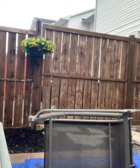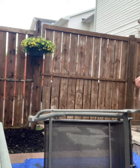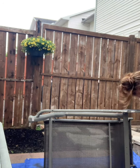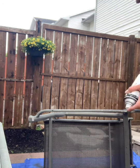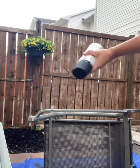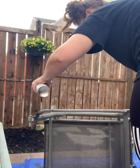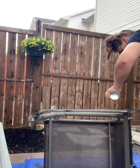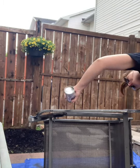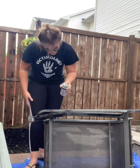Then it was time to spray paint. With the black spray paint, I worked my way around the chairs. I opted to start them on their sides — I'd do one side, let it dry, then flip to the other side, let that dry fully, not just dry to the touch but for a few hours. Then I did the front — the part you sit on, the most visible part. I did the sides first because if there were any scuffs or imperfections, I'd prefer them on the sides where they're more inconspicuous.